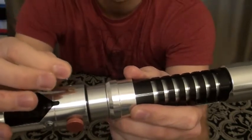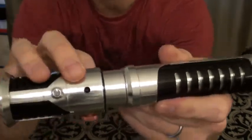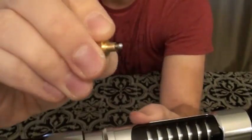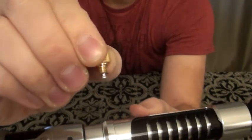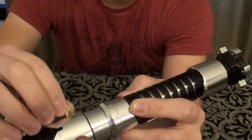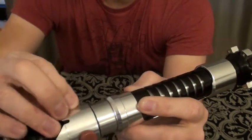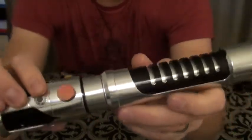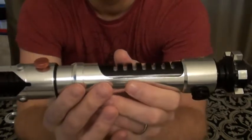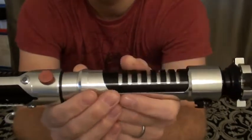What I ended up doing — I saw this on a video by Jedith Sabers, which I believe is run by David Maldonado — he gave me the idea for this. Deep inside here is where I have a small tactile switch. I drilled through the pipe there and I used the end of a rivet, the stem. I have the ball going in for increased surface area to hit the switch, and then on top I just basically glued the gem — the little plastic purple gem — down onto it. It makes a nice little auxiliary switch.